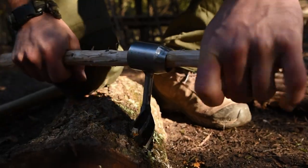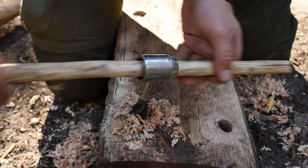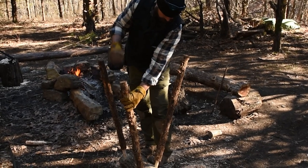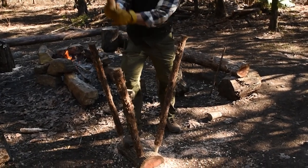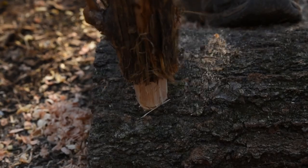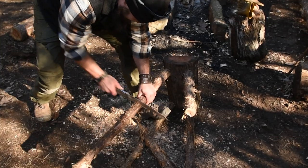Really take your time getting it going and make sure it's correct the first time, or you'll be starting over and have a worthless chair. In this case, we drilled all the way through — you don't necessarily have to, but personally I think it makes a stronger leg the longer the pegs are. The advantage of the settler's wrench is that it's one-inch diameter, one-inch hole, so the pegs you create fit really tight. There's no way you're getting that out once it's in — it's a super tight fit.